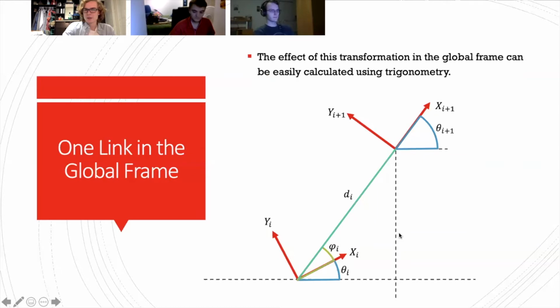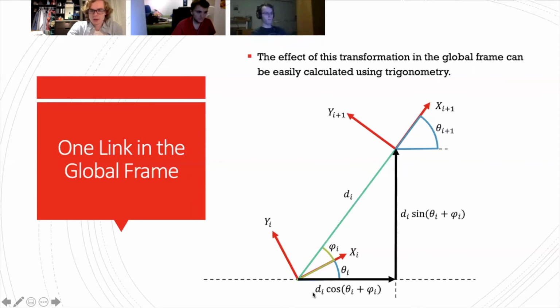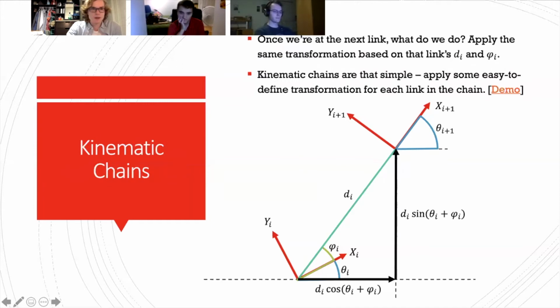And you can maybe see how this could be somewhat trigonometry related. The translation is going to be a function of this angle, and we're displacing by some radius. So one could imagine there's going to be a particular solution for that. It's the radius times the cosine of what the angle was. Similar thing, sine corresponds to y, and this gives us the exact thing we want. This gives us how to compute this angle. It's just the sum of these two because this line is parallel to the offset from the link, and then we have our x and y offsets to find the next link's position.